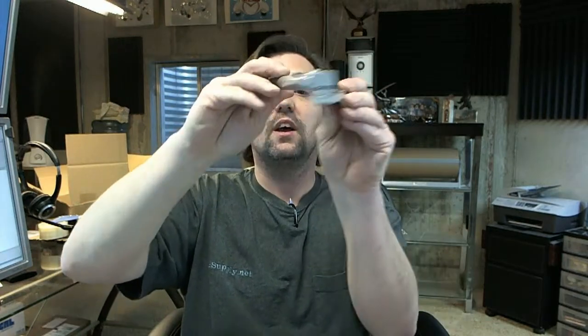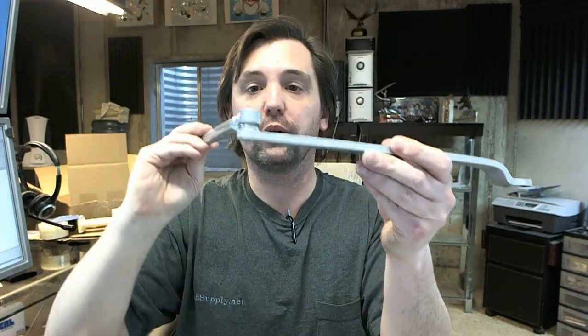There are descriptions of all of those in the links below this video in the instruction sheets, so I won't belabor all those points here. The location of where you install the closer on the door or on the header is directly related to the degree of opening that you want, so you'll want to make sure to review the instructions fully before drilling any holes. You'll also want to make sure that you get the distance from the top of the door down or from the header exactly correct, because if your closer is not mounted correctly you'll have the arm scraping on the top of the door if your dimensions are not exactly perfect.